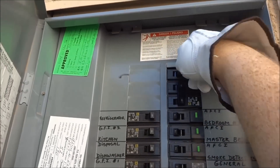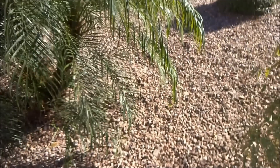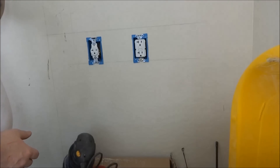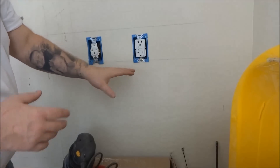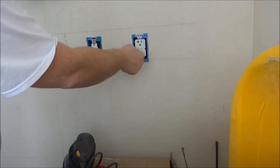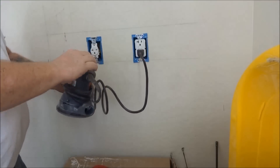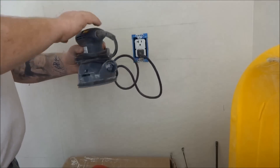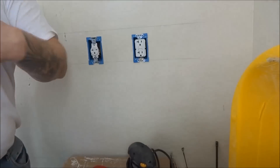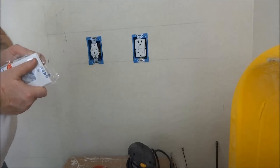Kids are back home from school. One breaker on, two breaker on. We got everything in, we got the box powered on. Just so you guys know, when you get a GFCI outlet you have to press your reset button — when they come you won't have to press the test, but you will have to press the reset in until it clicks so it will work. So let's go ahead and plug a device in — and voila, we got some power. We are good on the power side.